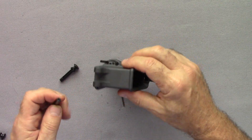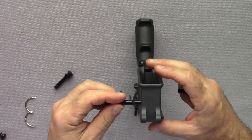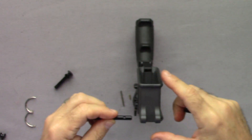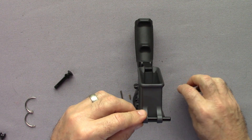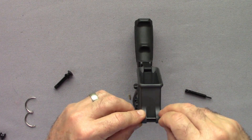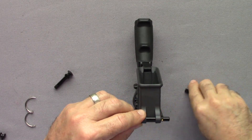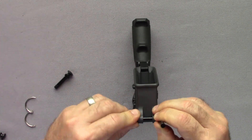But all in all, it's quite simple to use. You'll see there's a hole right there in the tube, so you're going to put that through like so. You're going to drop your spring in, drop your detent pin in, push down with the other part of the tool, and rotate.